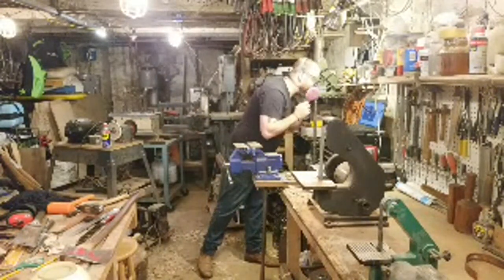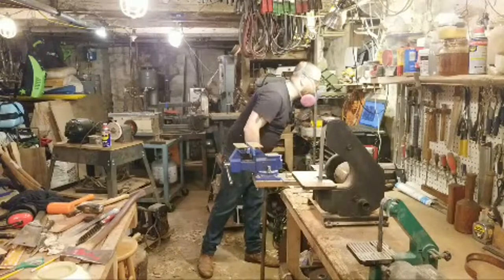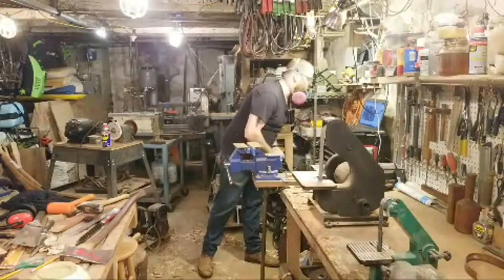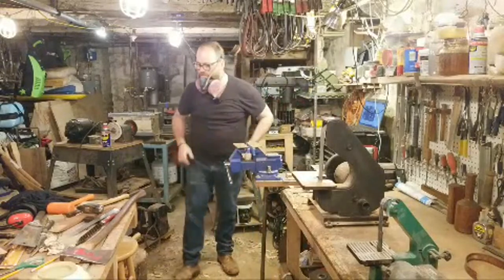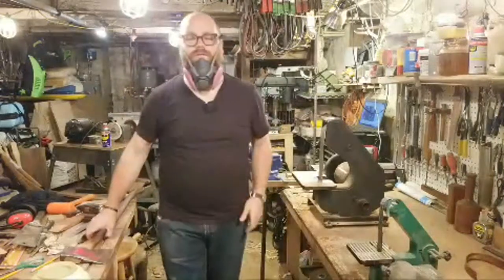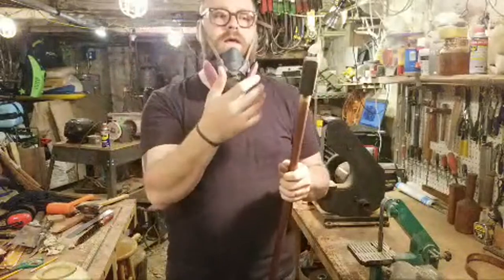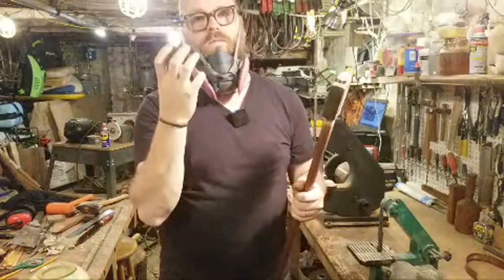Hi from Bates, MO, we answered him. Do I change the angle of the wedge depending on the depth of the cut? Yes, the depth of the kerf. And what is the ideal depth of the wedge? So two questions. One was, do I change the angle of the wedge depending on the kerf, how deep it is? Yes, usually I change the angle of the wedge depending on the type of wood it is.